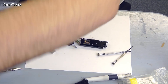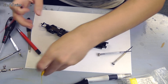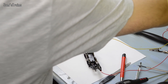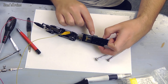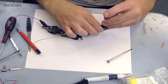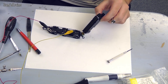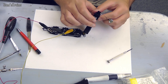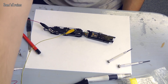Now I'm going to power up the motor. Because it's not connected to the track, I'm going to connect my crocodile leads directly to the resistors on the circuit board. As you can see, that gear is moving and turning, though it seems to slow down occasionally which isn't brilliant. The eye mechanism is also working — just make sure you don't put that eye piece on too tight because that was causing it to lock up. But that's sorted now, so we're going to disconnect the clips and move on to the important part.